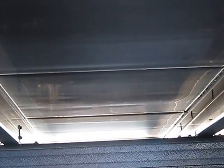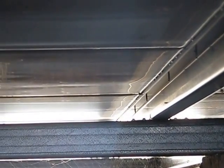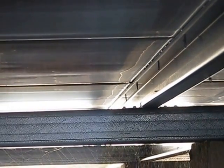Now, one thing I'm going to show you is the floor. I hadn't mentioned this, but in the $20,000 that we spent to get this pile of materials, the floors that I'm focusing on now are actually 50 mil thick insulated panels, SIPs. I'd never seen this done before, but the floor being one of the biggest factors in heating and cooling, you get a lot of heat transfer, cold transfer through floors, and that's why even in orthodox building methodology today, there's lots of regulations. Some councils make you actually insulate a floor. So this place is already insulated by these panels.